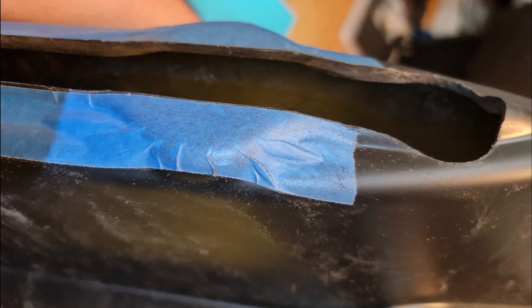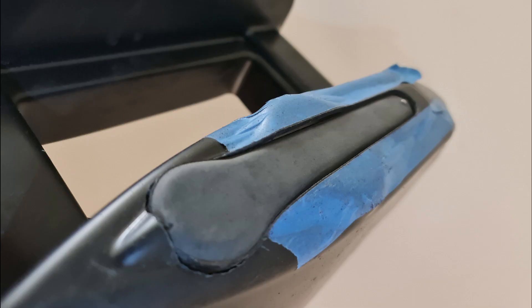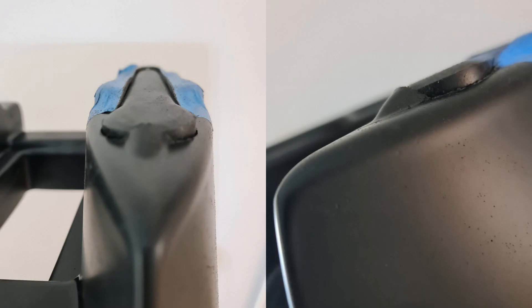The opening is obviously too coarse and we need to file it down until it fits exactly. Be really, really patient here — you don't want to make this hole too large. Then finally test it out. It should stand a little below the keel. As you can see here, the long thin part is mostly flush, slightly lower than the keel of the hull, while the front part is raised, and that we need to take care of when we are gluing.